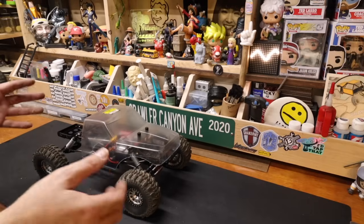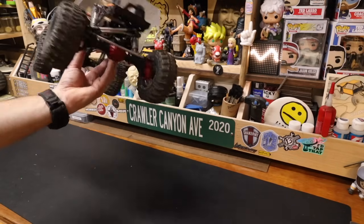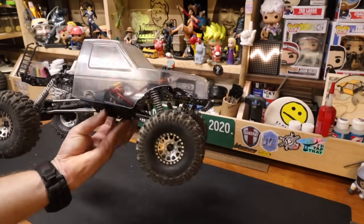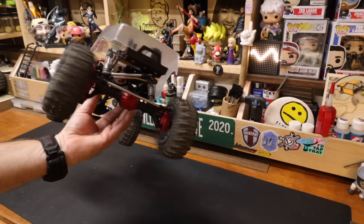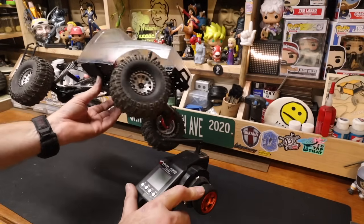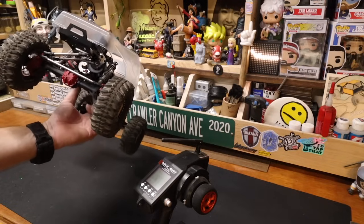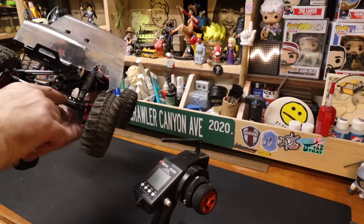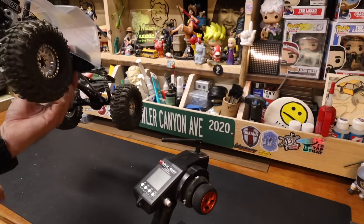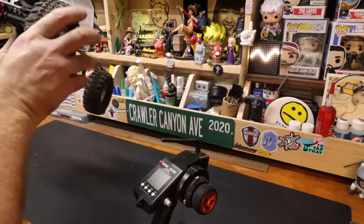Fastener optimization, fairly close. I don't think there's a lot that we need to change out. It sits pretty nice, compresses pretty nice. MEUS axles with chassis mounted steering. It'll do the, will it do the thing? Yeah, it's pretty on the quick side. I see a little, you see the shiny, a little extra shiny down there? Yeah, that one's leaking out of the cap. That one's dry, that one's wet. Both of these are, so it's probably mostly this one.